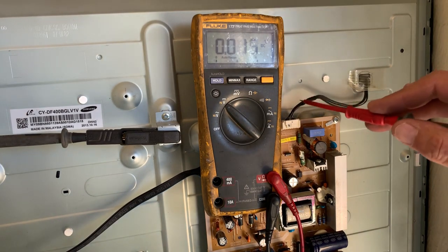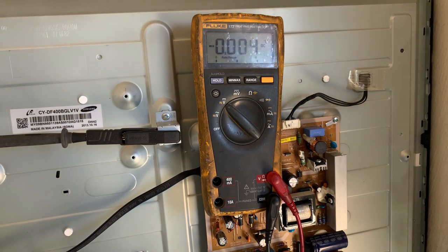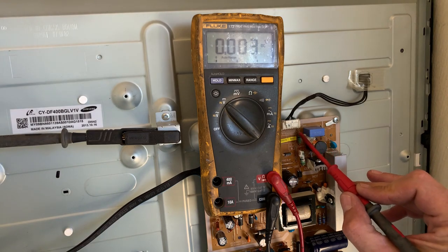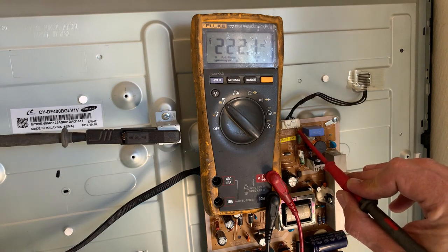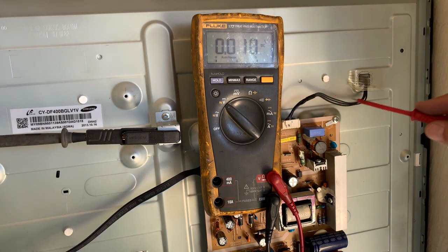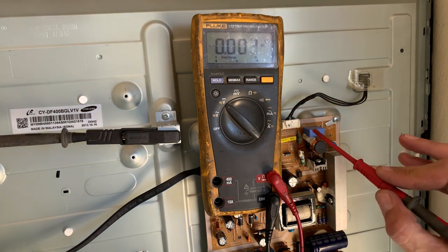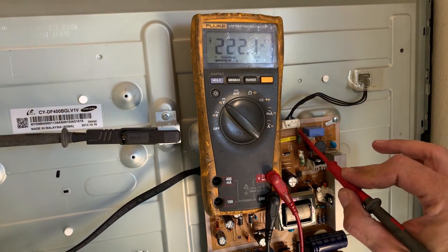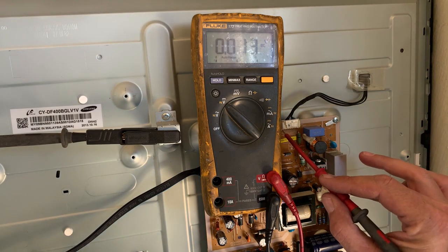first things first, we want to see if we're getting voltage out on here. I've switched it to DC voltage. I'm going to measure on the D plus side. And we can see I've got 222 volts of DC going out to the LEDs. Remember, they put all the LEDs in series because that way it's even current through all the LEDs, therefore even brightness. So we just have a look there again. One hand, 220 volts going out. Coming back,